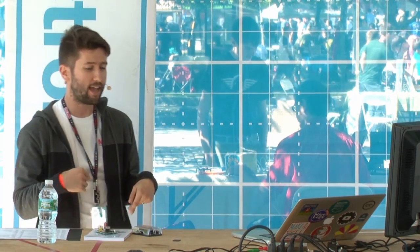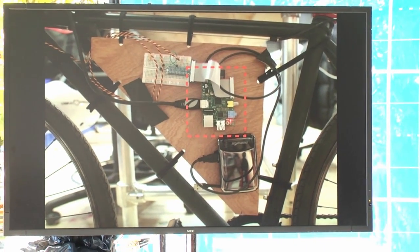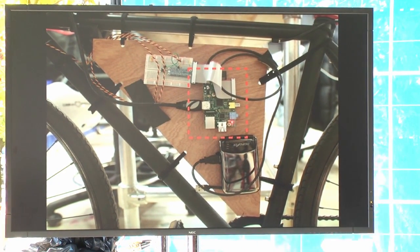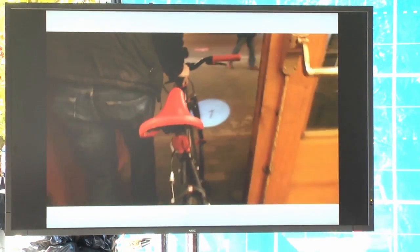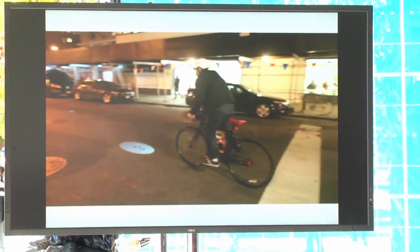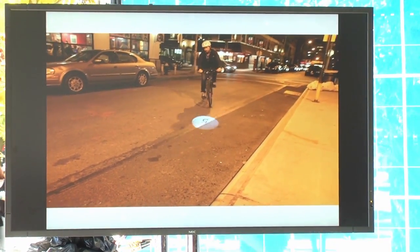Let me show you a couple of quick projects. I wanted to integrate the Raspberry Pi into my bike — I bike around New York City and wanted information about my ride while riding. So I built what I call a dynamic bike headlight: I strapped a Raspberry Pi to the bike, gave it a battery, added circuitry with a sensor on the wheel to measure speed, connected it to a battery-operated projector on the handlebars, and took it out on the street. It showed me the speed of my bike ride in the beam of the headlight.